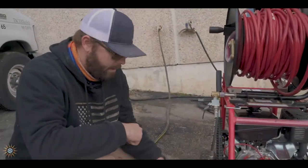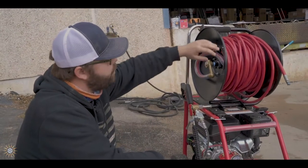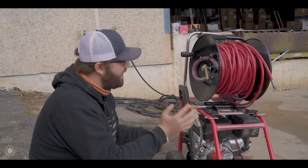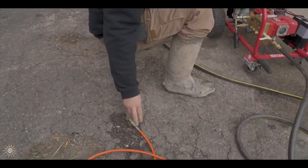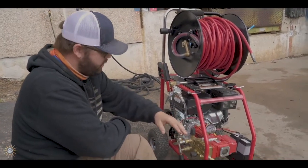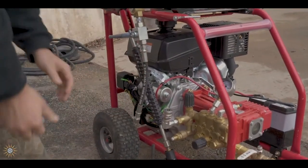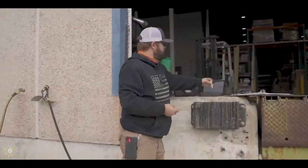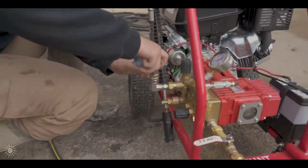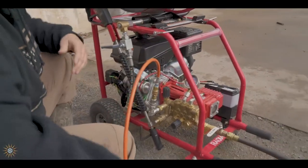Before we purge the whole system, check what type of drain you're going down. For bigger drains, the upper red hose is for three-inch and up - three, four, five, six inch, whatever you've got. The smaller orange hose is for two-inch and smaller - that's for your kitchen lines, tub, shower, or something along those lines. Today we're using two inch, so this quick-disconnect separates here. There's a quick-connect adapter for the orange hose - slip it on, use the other end of the orange hose, quick-connect it on, and you're ready to rock.